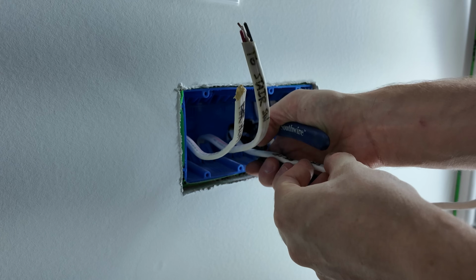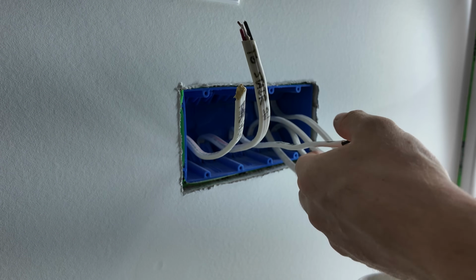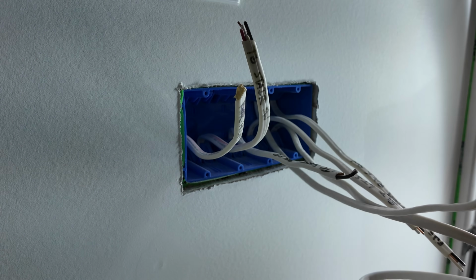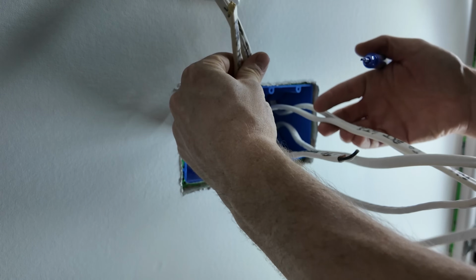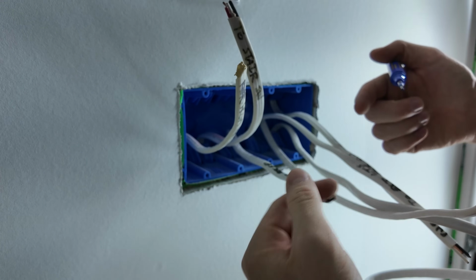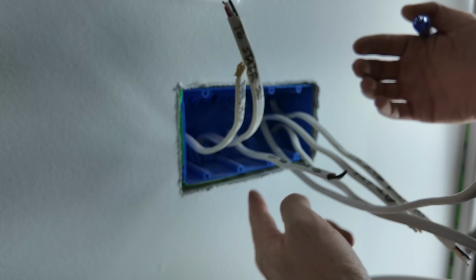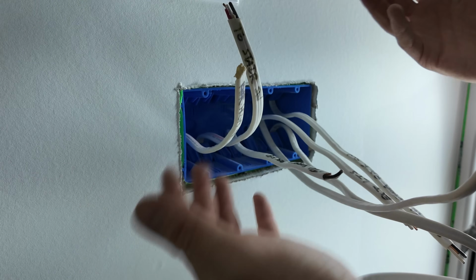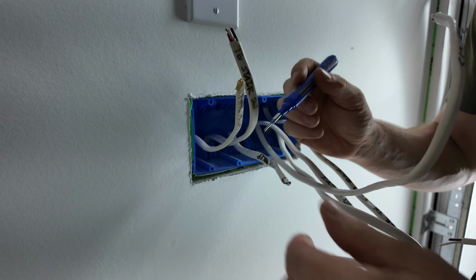I'm gonna follow my usual process for this, which is 1 wire at a time, strip the jacket off. I'll probably try to write the label a little bit smaller and put that on my hot wire. Group all my grounds, neutrals, and load wires in separate locations. I have 1 line or power wire coming in. I'll have to do 4 different pigtails for that line and for my grounds to hit all the different switches. Tie everything together and put the switches in. Pico markers are really nice for this because they're so thin.